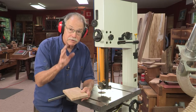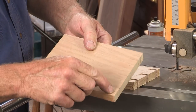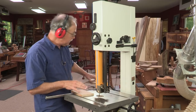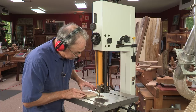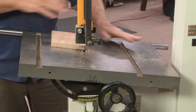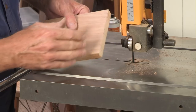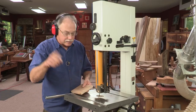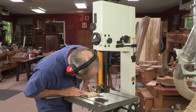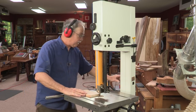We'll check the perfect fit. I have the pins laid out and the X's mark the scrap on both surfaces, because I'm going to have to cut some of the cuts — three of them — for the pins on this side, with the table tilted down and locked at seven degrees to this side. Then I rotate the table down to seven degrees on the other side and make the corresponding cuts. Do not cut into the pins — leave the pins. Keep that cut into the scrap area.